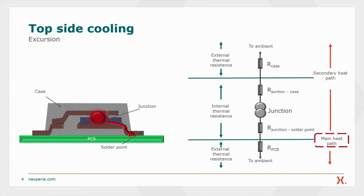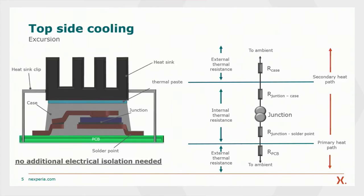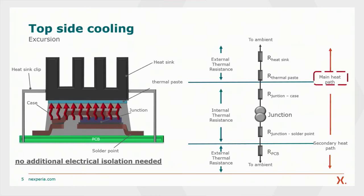For topside cooling, we need to make some minor adjustments. We put a thin layer of thermal interface material on top of the package to ensure a smooth surface and good thermal conduction. Then the heat sink is fixed by clips or screws on top of the package. The latter allows you to precisely adjust the contact pressure of the heat sink on top of the package, which plays a really important role in thermal conduction. Since topside cooling creates a new main heat path from the junction to the ambient, in case of heat generation the heat will be dissipated through the broad copper clip, through the mold compound, over the heat sink into the ambient.